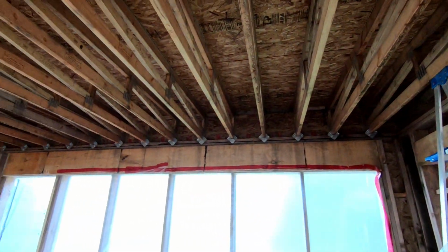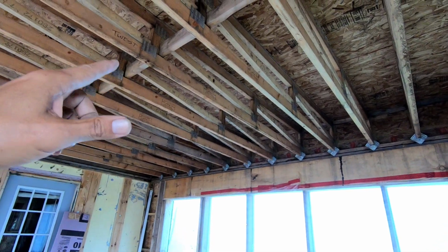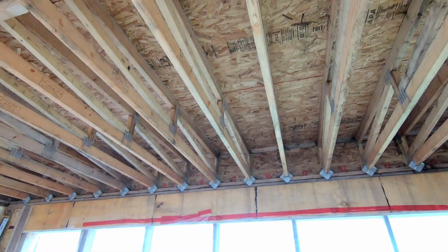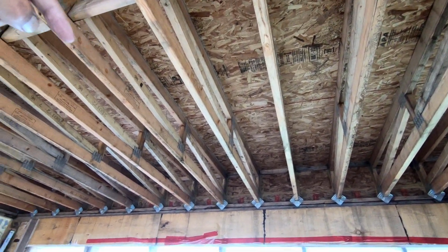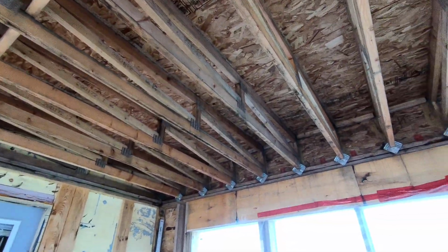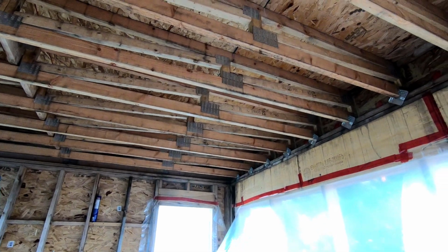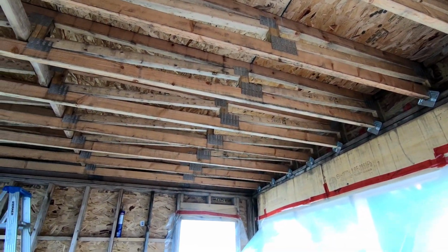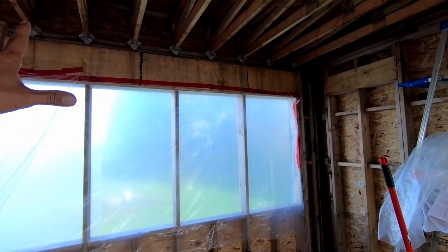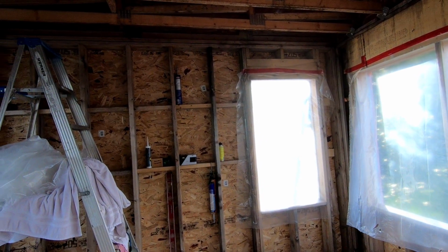So as the deck dries, I'm going to get up there and sand any bumps and lumps and try to find any screws that need to be screwed in a little bit more or removed altogether. Nails, anything that's going to poke the rubber needs to be addressed. Then, if there's any time left, I might do some of the foam work. I'm not going to start on the rubber at all today.